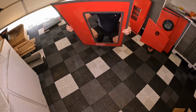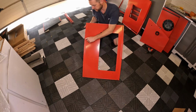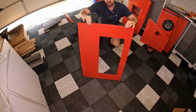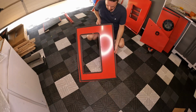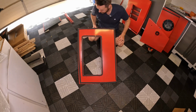Essentially, if you're looking at this front side, you want the tape directly behind every single one of these holes. That way, once you put your bolt through and go to cinch everything up, you're tightening against that gasket so you're not letting anything out. So I'm kind of glad that I don't have to do that. Seems like it's a pain, making all these turns and 90s. It's just one less thing off the checklist.